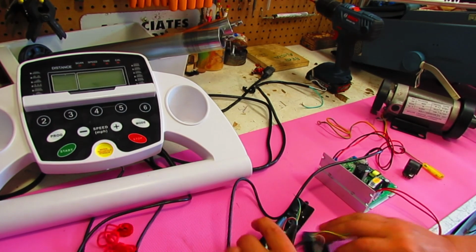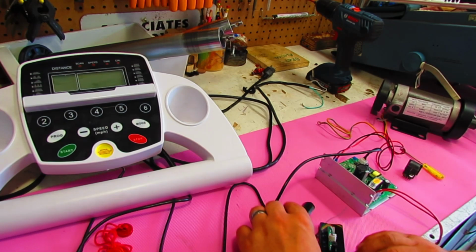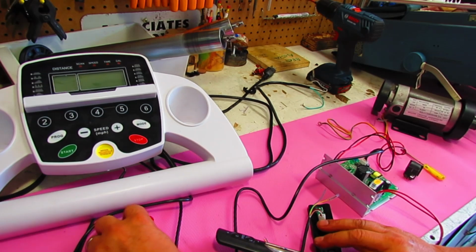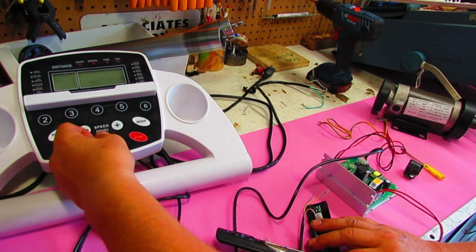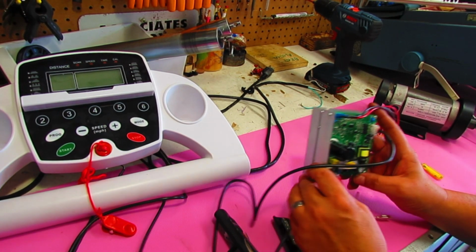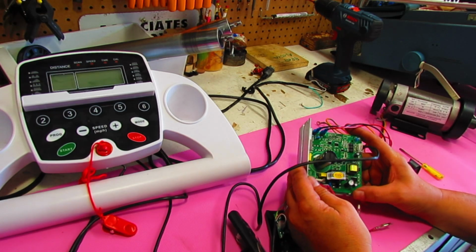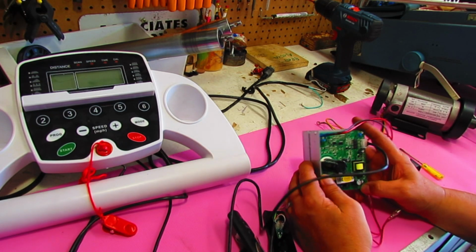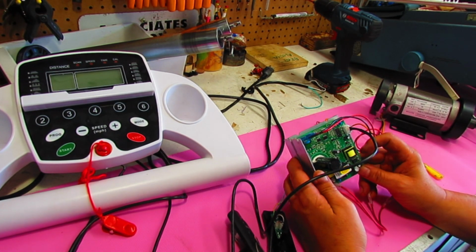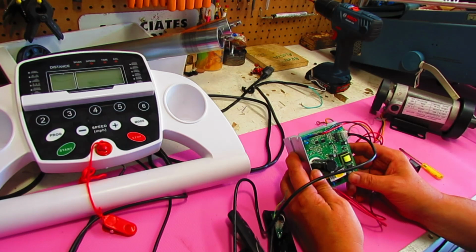I kind of put everything together. There was a couple of controllers for the hands, a start stop, and speed. They also had some sort of probably conductivity meters going here. I ripped those wires off by mistake. The kill switch, right? And everything else seems to be, there's your control board. Doesn't seem to be any sort of name brand board. Not a lot on it. Big cap, tiny transformer. I can't imagine that's doing much, probably, other than maybe stepping it down for the 5 volts for the electronics up there.